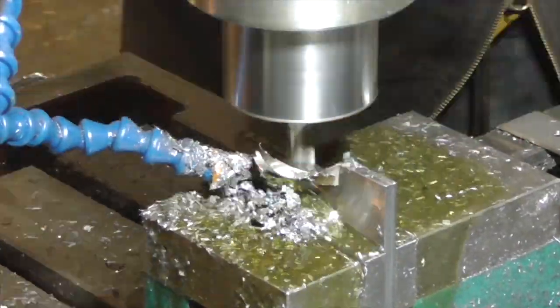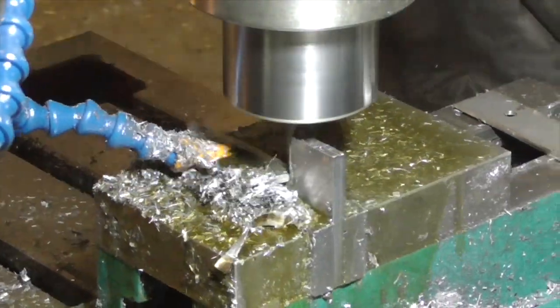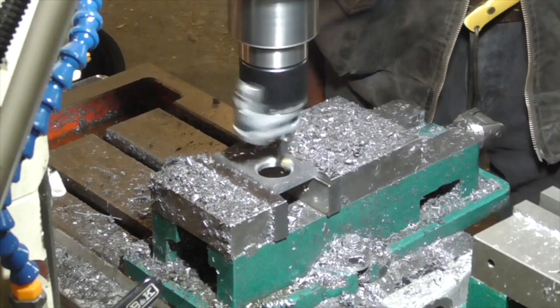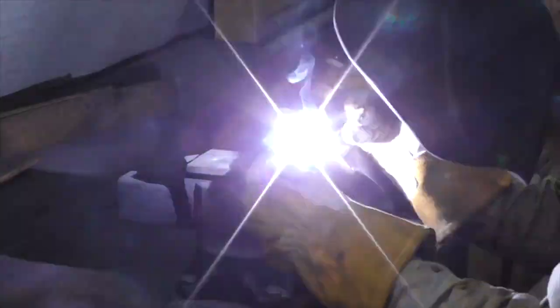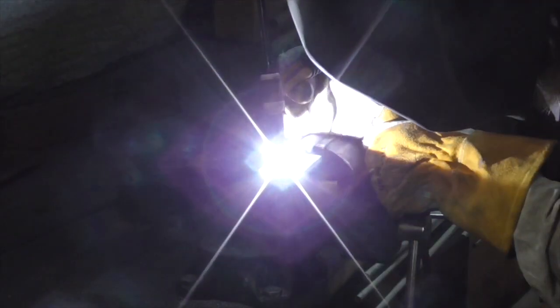And I think I've come up with a solution to this problem. Namely, I start by machining a solid mold body with an integral handle and sprue plate, a large cylindrical bore down the center, and an adjusting screw at the bottom of the bore.